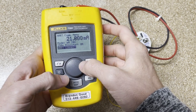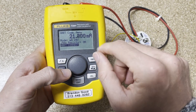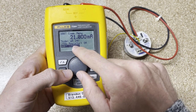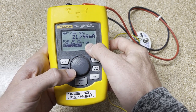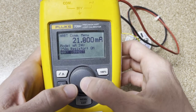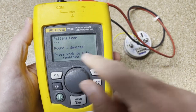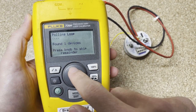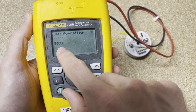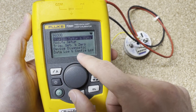Since we're on the bench, we're going to supply the 24V loop power, milliamps, and we've got the 250 ohm resistor on. If you had that externally, you could turn that one off. We hit this and it's going to go searching. It found one device — we know there's no more — so we just hit the knob and skip. Look, this one's named after me: Brandon Good, and it's acquiring the data.